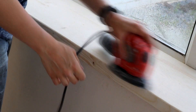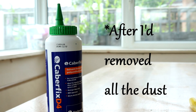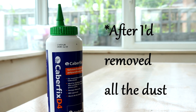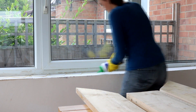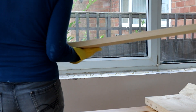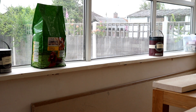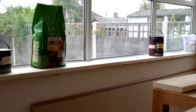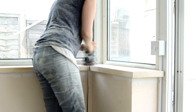This was a really long and dusty process, but it was something I didn't want to skip. Then to glue the windowsills down, I used Norbond D4 glue that my dad gave me — I'll leave the link below, it's about a tenner and it's really, really strong, stronger than wood. I drizzled it over wearing gloves, bearing in mind it does expand, so I needed weights pressing down. I had to be creative grabbing anything we had — boxes of alcohol and empty gas bottles came in handy. Once it was set, I just went over the mitred corners again.